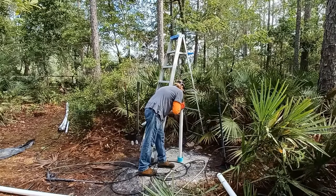And the trash can is our water supply to bring the water into the pump. I've also added the garden hoses. That's from the new well, by the way, the one we put in about a year ago. It still works great, and now that's where the water comes from. But anyways, we've got inlet pipe adapting down to 1 inch, so we can create a lot of pressure. And as that mud pump pushes it out, it should be able to blow all the sand at the bottom of that shaft out of the way and sink this 40 foot pipe down in. Then we're going to quickly pull that out and go ahead and reinsert the well point.